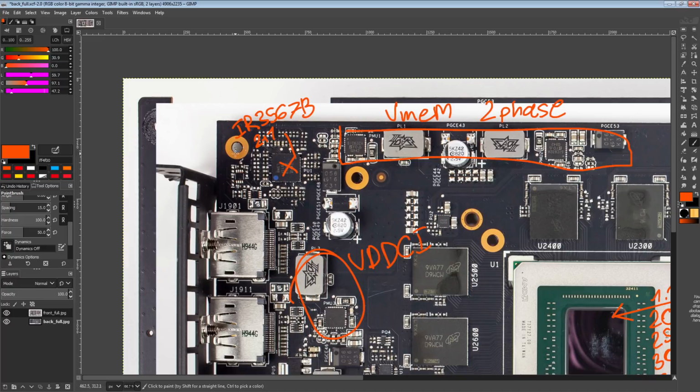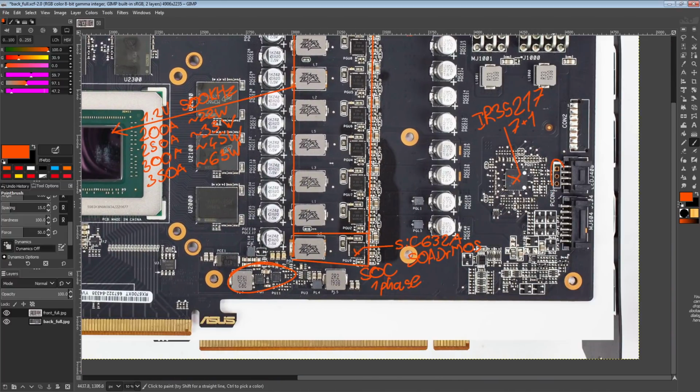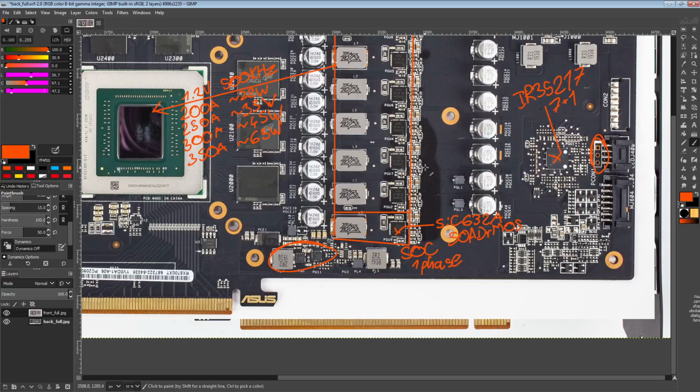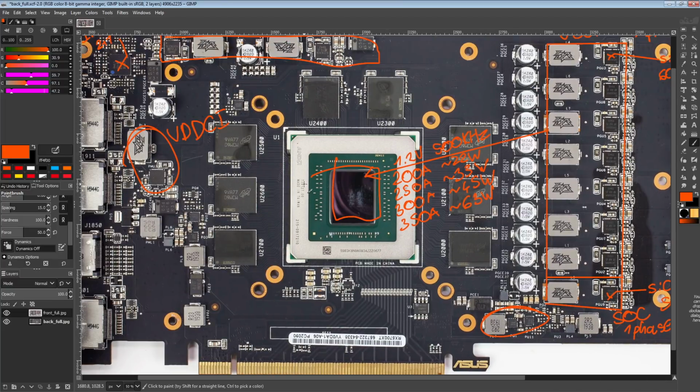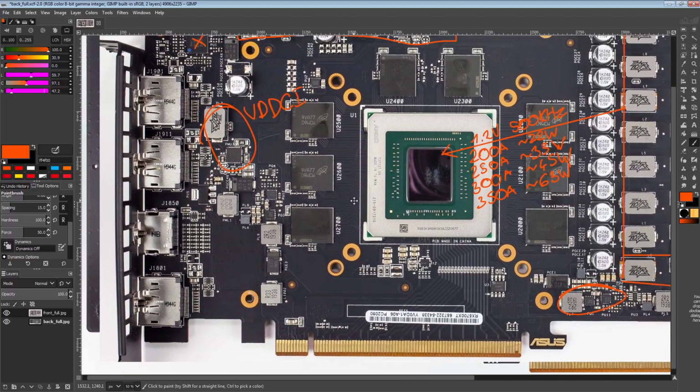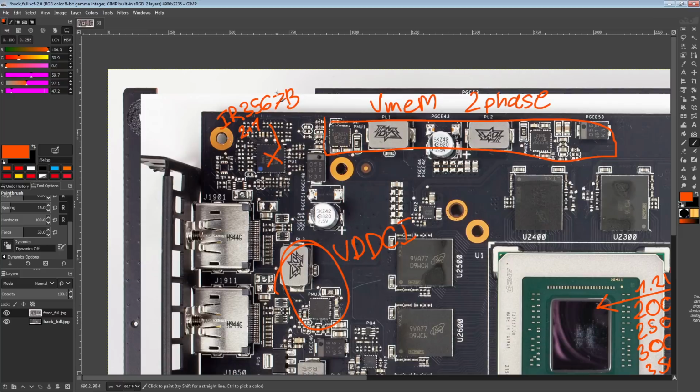And I think, well, actually, not I think, definitely, if you just connect over here, you'll be able to talk to both of these. The biggest problem is if I was trying to manually take control of the controllers, you would probably want to disconnect them from talking to the GPU core, because a lot of the time that can cause all kinds of nasty conflicts. And the other thing is the whole point, in my opinion, of trying to talk directly to the controller would be to make the core think that you're not actually doing anything while you're changing voltages and all kinds of things. So the core has no idea that it's pulling way more power than it's supposed to be pulling, which is the best way to do any kind of overclocking, right? So yeah. Anyway, that's the control scheme here.